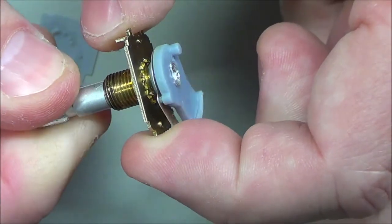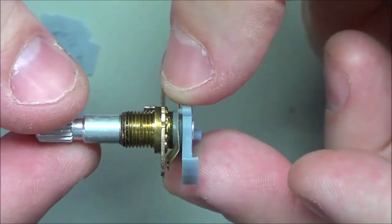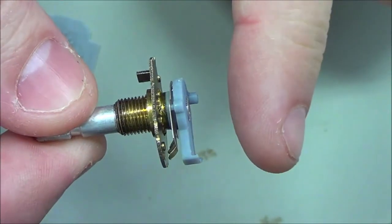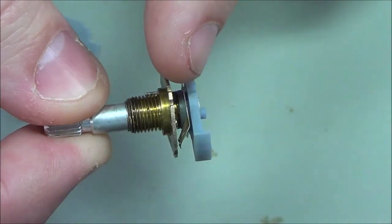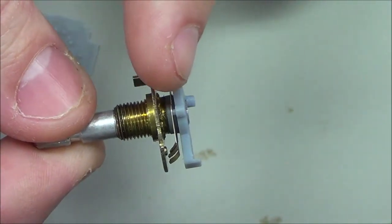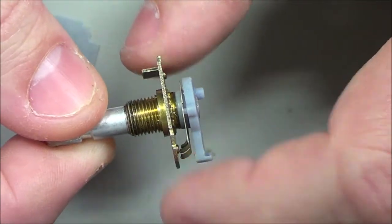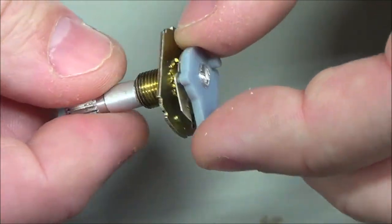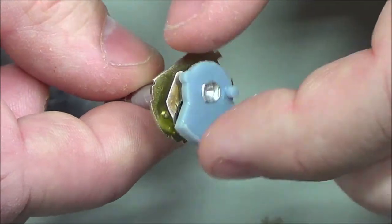What I need to do now is take this shaft off this piece, because now I have to put it back together in the potentiometer and mesh all the different layers. It's the bottom with the switch, and it's this piece, then it's the wiper here, and then it's the conductive part, the conductive ring, the carbon, yeah, the resistor part, and then this goes on top, and of course the shaft has to go through. So that actually turned out really good. Let's just see how well it holds up